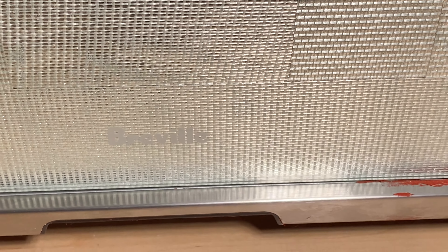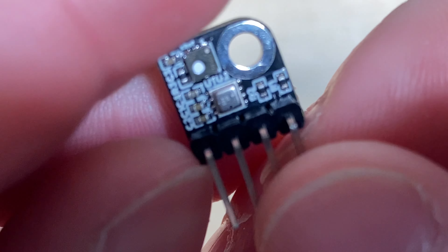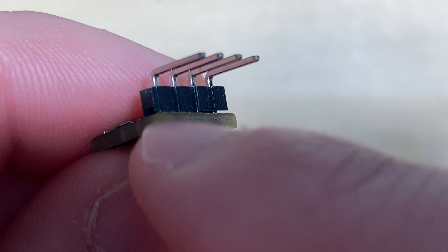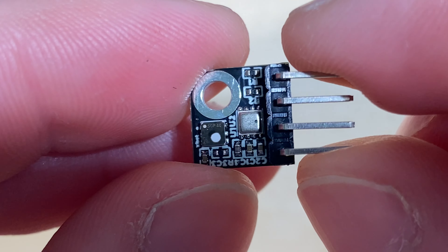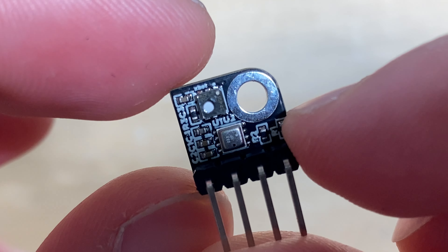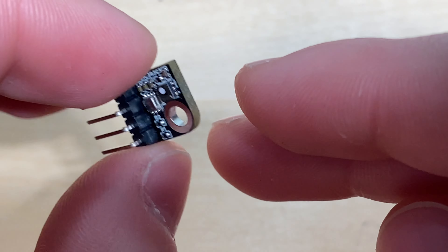After that first success, I decided to solder another PCB fully populated. While it did go okay, the SGP40 — I didn't push it into the solder paste properly. It didn't solder on the pads correctly and I tried to fix it with a hot air gun and ruined the SGP40. Also while soldering, I observed through the small window and some pads really didn't solder in time. So I decided to create my own profile for the solder paste I'm using. With the custom profile, I did a third PCB reflow, and it turned out pretty well — all the tiny SMD components were baked in the reflow oven and it worked great.